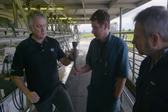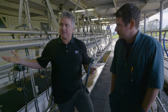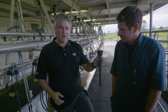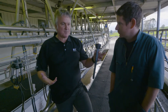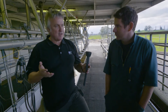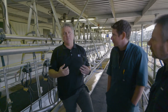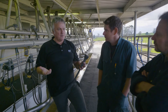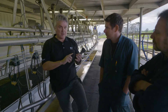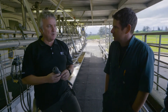The other part of pulsation is the ratio — the percentage of time it is milking versus the percentage of time it is resting, and that sets the speed of milking. This plant is no doubt set up at 60-40: 60% of the time milking, 40% resting. If we increase the ratio to 65-35, we'll milk cows about 8% quicker; increase to 70-30, another 8% quicker. We only rarely use increased pulsation ratios — for example, where we've got automatic cup removers, or in situations with a lot of milk, a max-T milking procedure, or once-a-day milking farms where we've already limited the milking time.